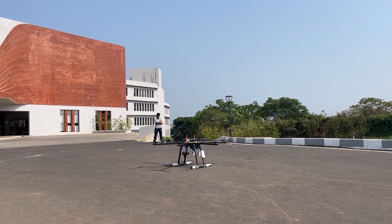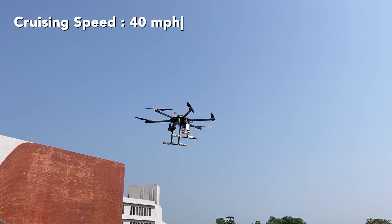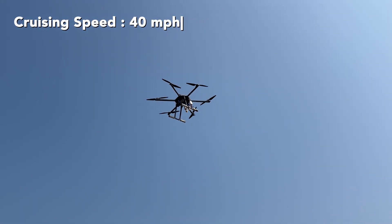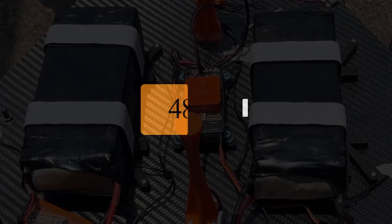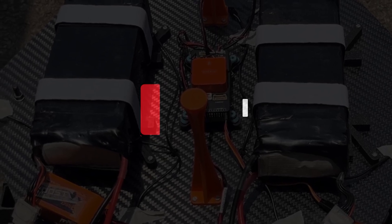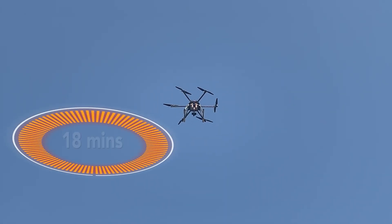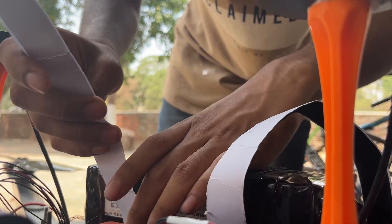To maintain this, Freya is designed to perform flight operations with a cruising speed of 40 miles per hour and a top speed of 69.35 miles per hour. We also accounted for a safe limit for battery discharge, ensuring that it always remains over 20%. This limit gave us a flight time of 18 minutes per battery, which allows us to complete the mission with only one battery swap.